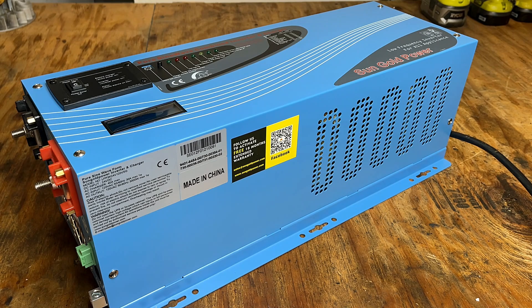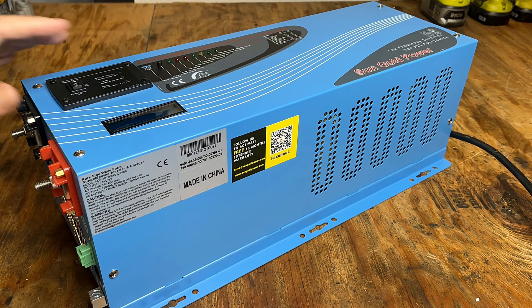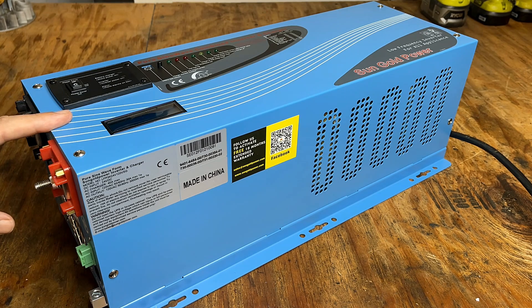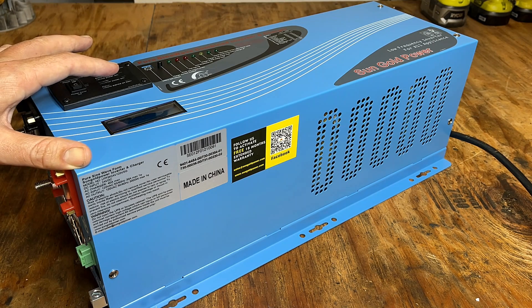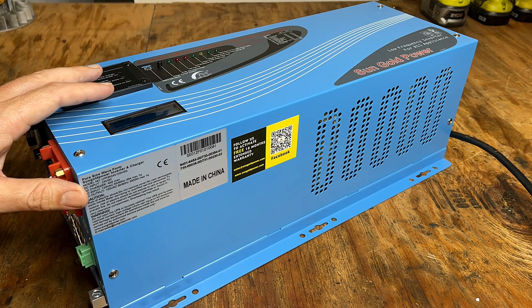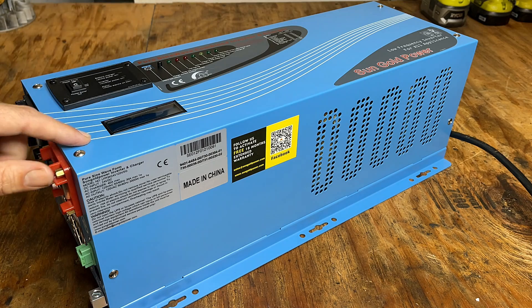After a period of time, when your battery bank runs low and AC power hasn't been restored, this unit can call out to your generator. If you have a generator properly connected with the ability to remote start, that generator will start feeding this unit again with AC power, top off your battery bank, and continue supplying power to anything connected. It also has an auto transformer, so if input power isn't at 120 volts — say it's coming in at 100 volts or over-voltage at 130 volts — it can step the AC power up or down to get it closer to 120 volts, preventing a failover to the battery bank. If power is too far out of spec, it will make that decision and fail over to batteries.